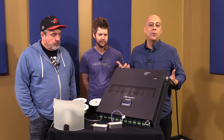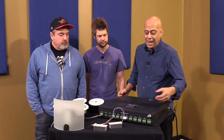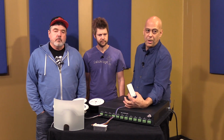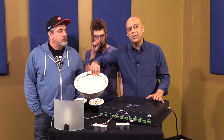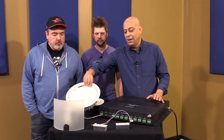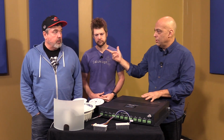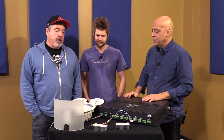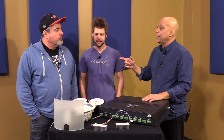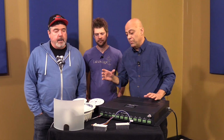Folks, this is the DMX1800. You put this in a closet in your electrical room. It'll power up to 120 of these. On the 30-watt versions, 48. And on the 50-watt versions, 24. One of these will do 24 of them. Available in warm white or RGBW. Well, they actually made it more like an amber. It's RGB warm white.